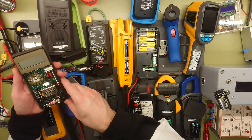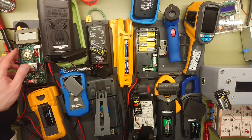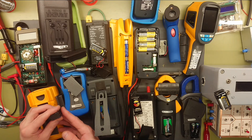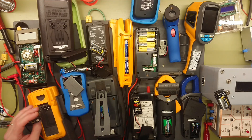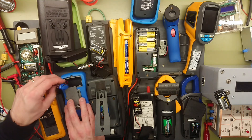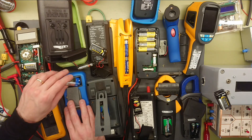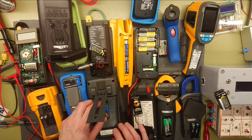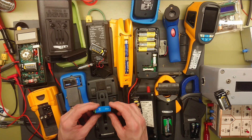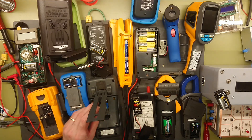The old Fluke 77 has an industrial Energizer battery, which I put in recently — stamped for 2022. The Fluke multimeter has some no-name alkaline Power Maker batteries, still stamped for 2023, so no leakage assumed — those are good. The cheap Chinese LCR meter has one 9-volt battery stamped for 2012, and it shows a battery symbol when turned on, so this is getting changed. My regular DE5000 LCR meter uses a Golden Power Green Energy battery dated 2018 — no signs of leakage and it doesn't ask for a new battery, so it will remain the same.